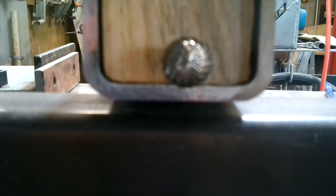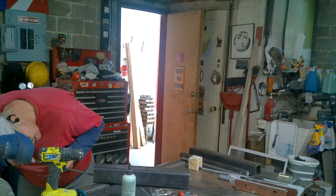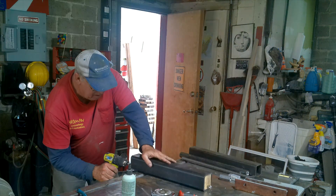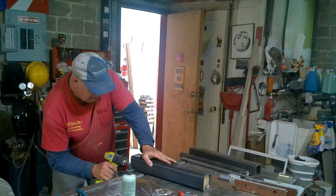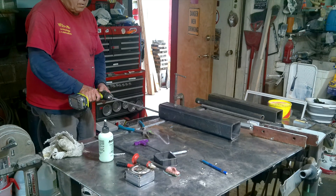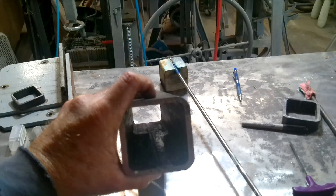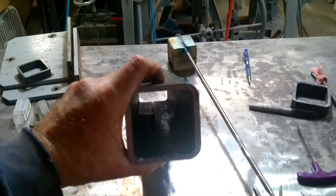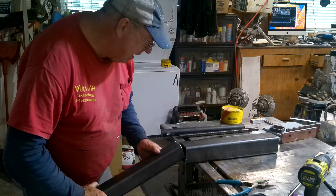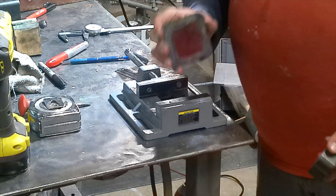You can see there I hit that 32nd-of-an-inch dig into the wall just spot on — I'm very happy with that. I'm applying anchor lube to the inside of the tube on the weld to give the burr some lubrication so we don't burn it up. That's a beautiful cut — absolutely beautiful. Now it's time for the first test fit. Yes — that is just what you want.